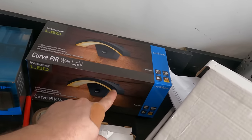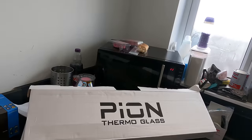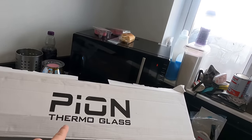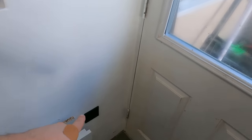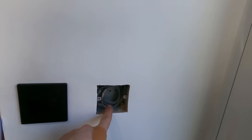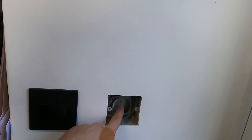And then this integral LED curve wall light with PIR, which is just going outside the back door there. As for the thermo glass thingy - that's because it's going up there on like a 45-degree angle. That's a flex outlet plate that it connects into - we've already done that. It's wired from this fuse spur there, which comes up to the thermostat. I think I might have that now, and then I'll put the thermostat on there, which then runs over to that.